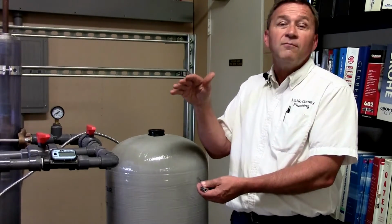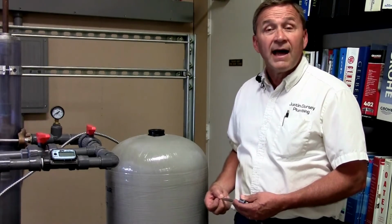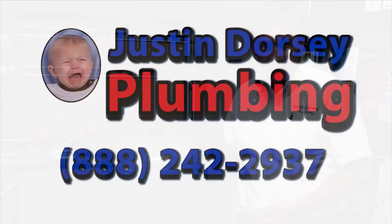If this is out of balance, the pump then kicks off and on more frequently, leading to early pump failure. This is a very common problem that we see, and something that you should be aware of and check periodically, at least annually.